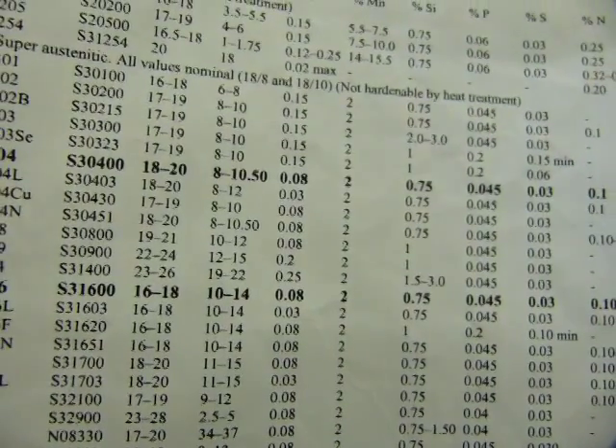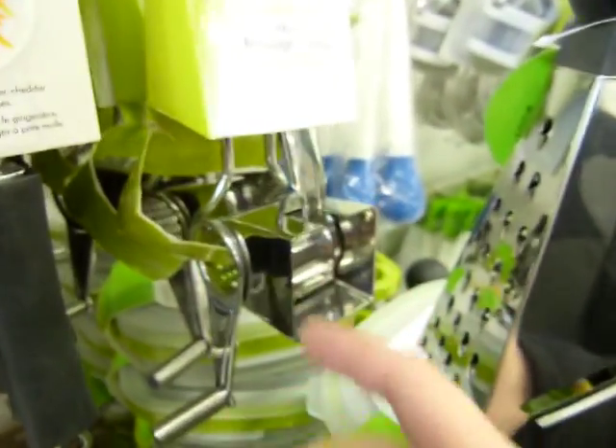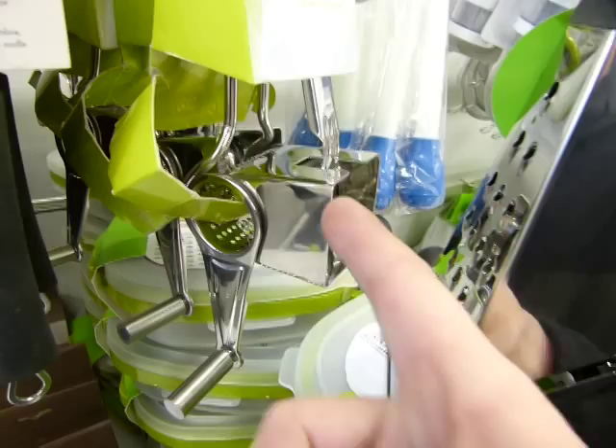Carbon content has to do with the hardness or sharpenability of steel. These surfaces — countertops, sinks — they don't need to be sharp; they need to be able to bend without cracking. And that's where these stainless steels excel.